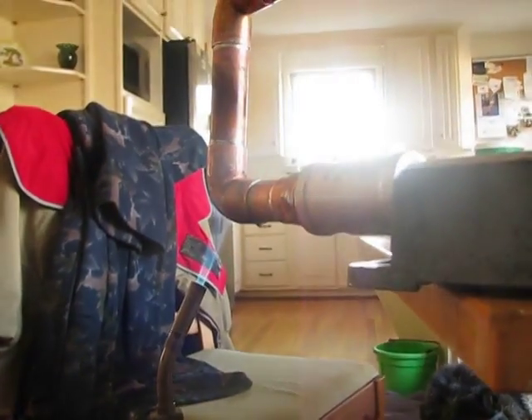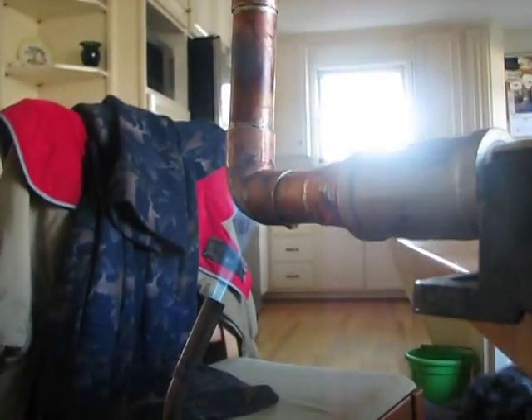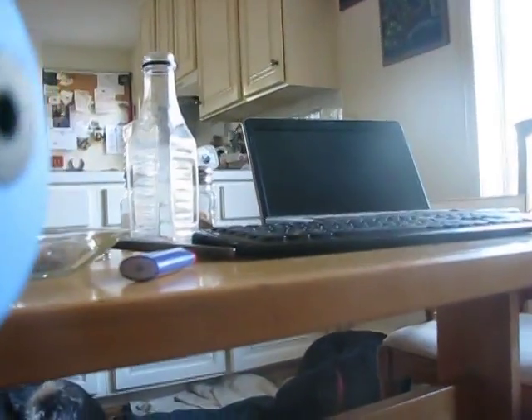Finally I'm getting some pretty decent sustained oscillations. You can see I'm heating here really low with the propane — if I turn it up too much I start melting the joints. I already had that problem once, which definitely caused an air leak and got some copper stuck in there. Now as you can see I'm not getting the oscillations I want, but I'm getting the oscillations that this machine seems to be tuned for. This looks like it's going to be a really good project and I can't wait to explore it more later.